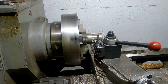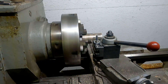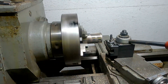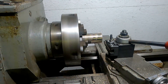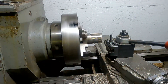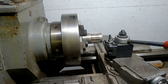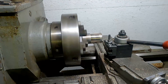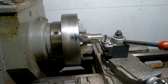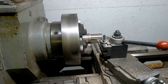One thing about this material is that it machines pretty easy even though it is pretty hard, but it just makes chips that fly everywhere — really sharp chips that are about twice as big as coarse ground table pepper. You can see on the front of the lathe it's all over the compound, the apron, and down the ways. It gets all over you and those little chips are very sharp. Making the final pass here, took about 50 thousandths off this diameter, just getting it trued up. I'm really pleased with the finish, and we'll be moving on to the boring bar now.